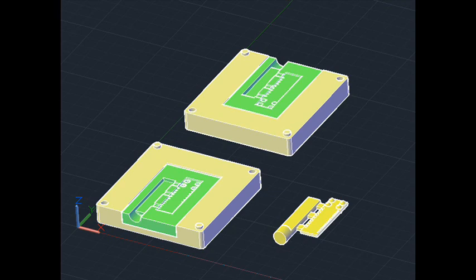The next picture is a concept through CAD of our mold — a mold and a sub-mold to cut costs. The outer mold is the standard 77 by 77 millimetres. I can do a longer one but only doing a test cast for now of the rivets, a sprue, and a plate. The final parts won't be anything like this — just to get a feel for the pulling of material, the vents, and how it comes out before I commit to a more permanent and expensive material.